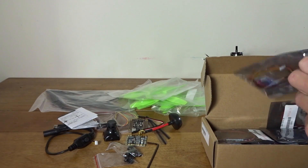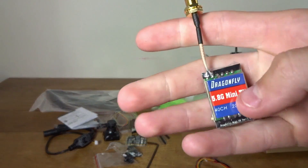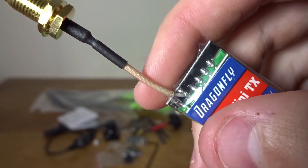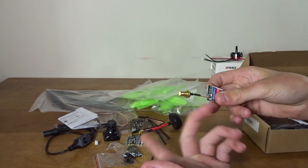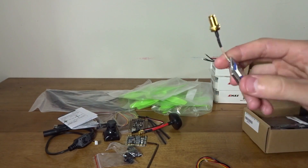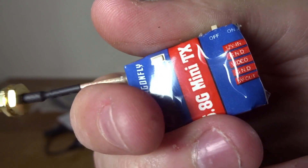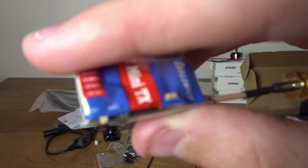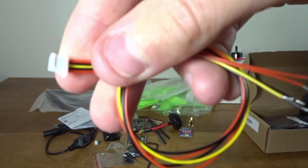There's also a little manual, and here we have what looks like the Dragonfly 200mW FPV transmitter. One thing I really like about this one is that it doesn't have the connector soldered straight onto it — instead it has a little pigtail extension, giving you great flexibility. In a crash, rather than snapping off, it'll flex and be much less likely to break. It looks like it has a little LED screen showing channel info, and there's an on/off switch directly on the board as well as a DIP switch. It came with a camera power lead with unsoldered pins.